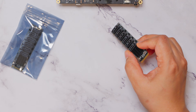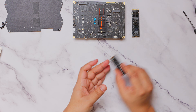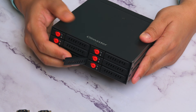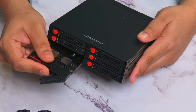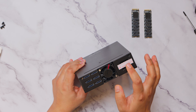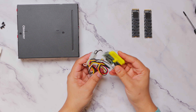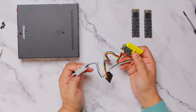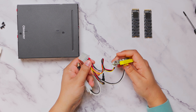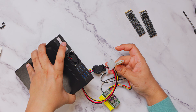The next part we need is an NVMe to SATA adapter card — here I am using one with six SATA ports, which will accommodate all the drives I'm planning to use. We also need a cage for our drives, preferably one with a SATA backplane, and I am using a six-bay 2.5-inch hotswap cage that comes with two Molex power inputs. For power, I will use the same Pico PSU from my DAS build. It has one SATA power output and one Molex output, so I used a SATA to Molex adapter to create two Molex outputs to together power the drive package.